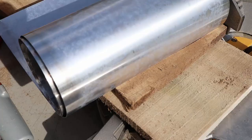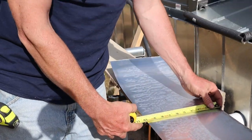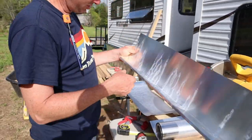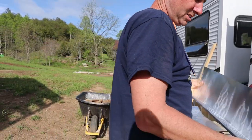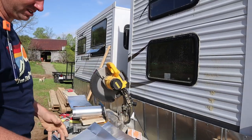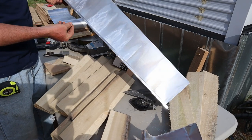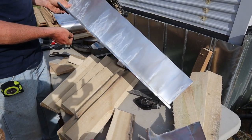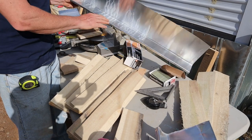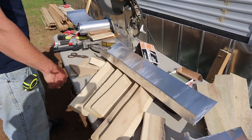So here's what we're doing, folks. Flashing. Hold on. I think it's 10-inch flashing. All right, yeah. What are we doing, John? 10-inch aluminum flashing. We were up on the cupola trying to flash this, freestyle, maybe. We tried doing it by hand up there, and that's what came out. Then we came down here and used a couple boards, clamping the seam, and now we got a nice smooth seam. We have a few buckles, but it's just for the water entry points where the top section of the cupola goes over the bottom section. We're just trying to prevent water from entering the shed.